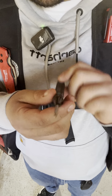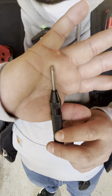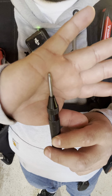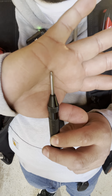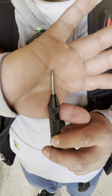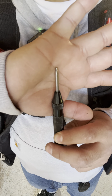On this side I have another sharpie, and I've got this Husky center punch tool. This is for when I'm drilling into metal, especially on finished product. It basically gives you a lead for the drill bit so it's not rolling around, and it makes for a cleaner drill hole on whatever you're working on.